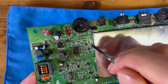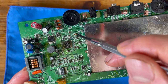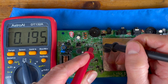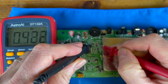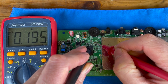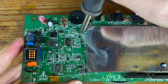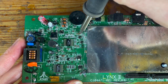You can see these are the different components we got replacements for, but this particular Zener diode seems to be the one that goes the most. I'm in diode mode on the multimeter — this is supposed to read differently in one direction from the other, and it's exactly the same — so it does sort of indicate there is something wrong with the power circuit. We're going to remove these components and replace them — there's no harm done, I've already got them.